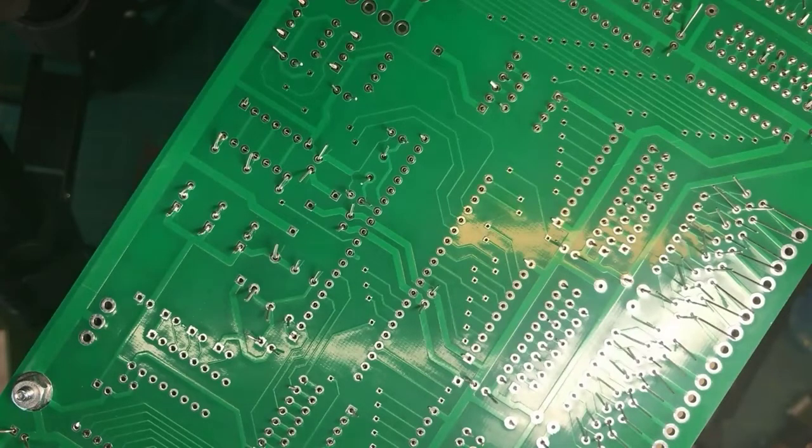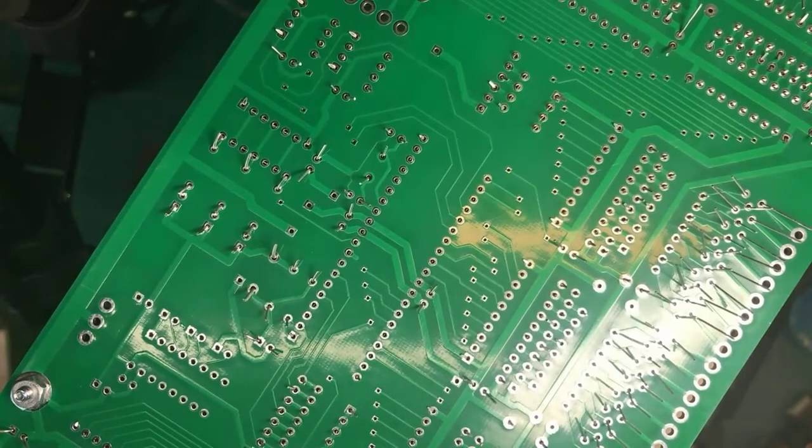In a circuit board where the lead's coming through the hole, you could tin it, yes, but what I'm more concerned about, frankly, when I've got a lead in a hole that's too big, is trying to figure out some way to keep it still while I'm working. If you tin it to make it fatter, that might help. But better, in any soldering, is that things do not move while you're working. And I'm going to show you on this circuit board some of the things that can be done.